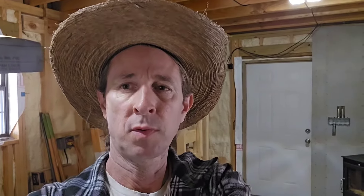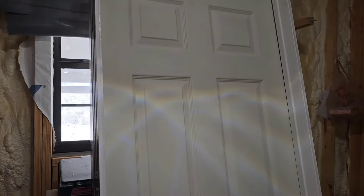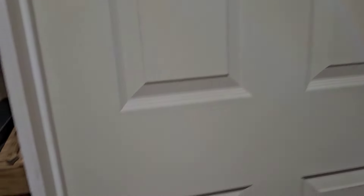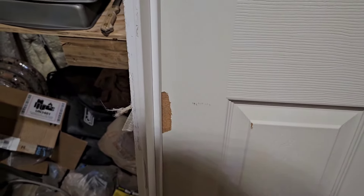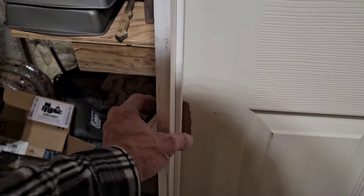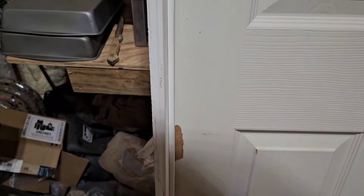So these are the two doors I'm gonna frame. With this one here, I didn't realize it was damaged when I bought it — it's got a big chunk missing out right here. I'll flood it with sheetrock mud and then cut some grooves in it to make it look like the grain. You'll never know it's there.